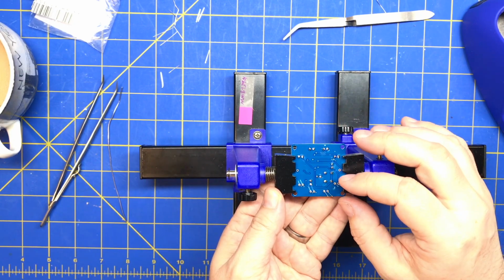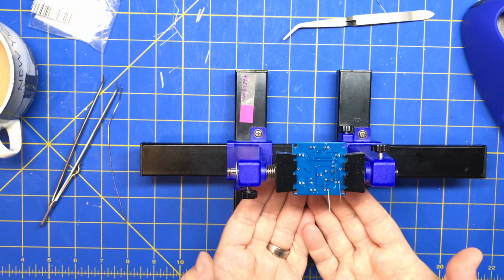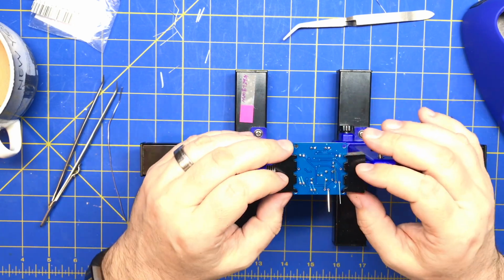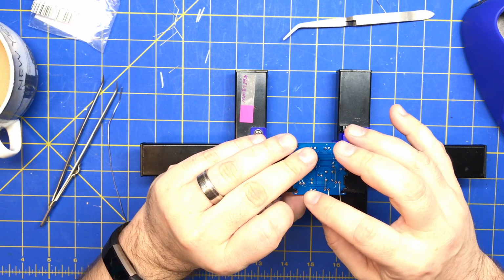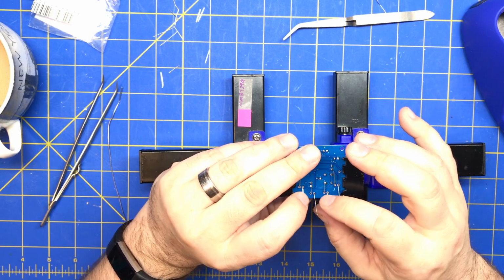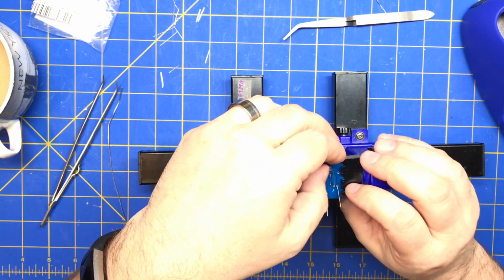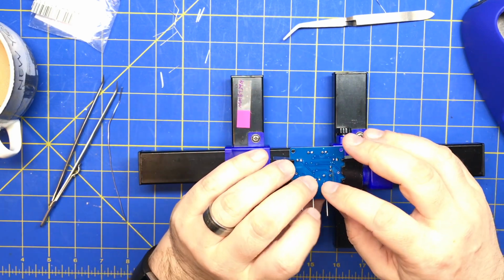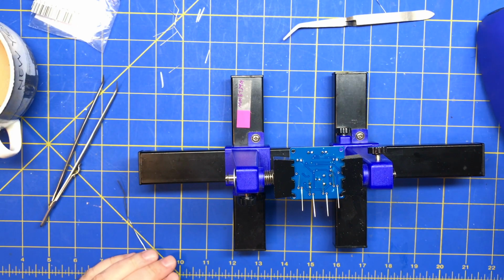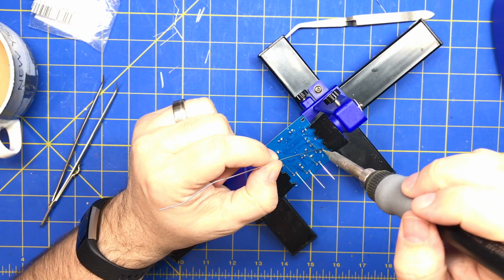All right. When I used to do a lot of through-hole components, I actually had a jig I made that had a foam sponge that would push. You could clamp it down. It would hold all your components, and then you could flip it over and solder them all. When you do a lot of through-hole stuff, that helps a lot. And there are commercial products you could still buy that have a rubber silicone plate that goes down and you flip the board over, made for doing large boards, like if you're doing old analog or discrete computers and stuff like that.